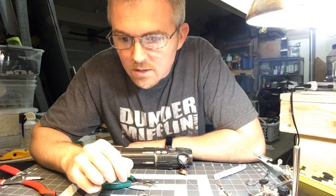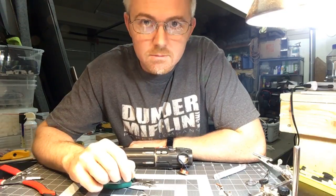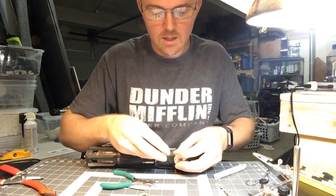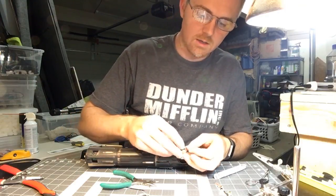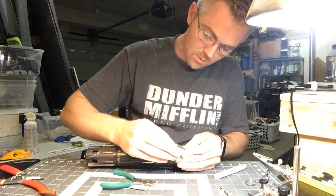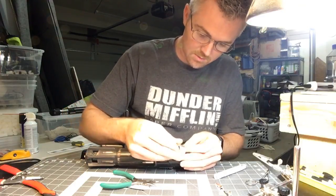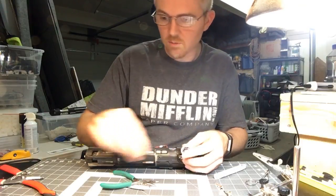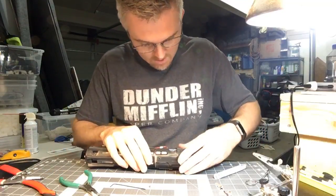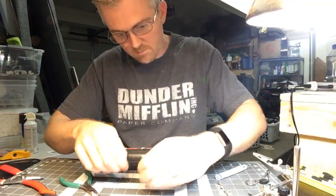Reese asked if I just bought a blade, no LEDs, would the lightsaber improve? Yes. It's not easy to replace because the blade and the electronics are all together. So you'd be better off just replacing it and rebuilding it. With the stock board, replacing the LEDs and making it a removable blade, you can get a considerably brighter blade than the stock string blade that comes with Kylo. Just replacing the LEDs with the board, and the tutorial on the Custom Saber Shop forums does that. It's not that hard if you have some basic electronic and soldering skills, and it doesn't take that long. You could do it in a day.